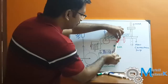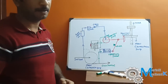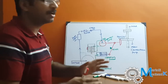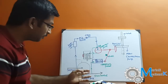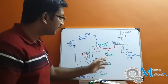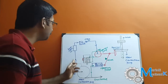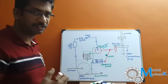As the discharge pressure builds up, the water pressure becomes greater than the spring pressure and depresses the spring. The lever moves to disengage the drive for the air extraction pump. So as long as there is water on the discharge side of the pump, the air extraction pump does not rotate — it is stopped. If there is no water pressure on the discharge side, the air extraction pump is re-engaged by this mechanism and continuously takes suction and discharge from the tank back to the tank, ensuring air or vapor on the suction line of the centrifugal pump is extracted.